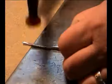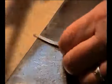As you hammer on the surface, it will mushroom over the edge, so we need to turn it sideways and use a flat-faced hammer to keep the sides of the platinum even. Then use the flat-faced hammer to smooth out the area you forged and to blend it into the ends of the piece.